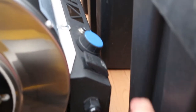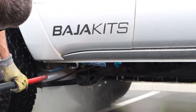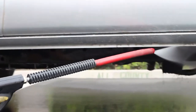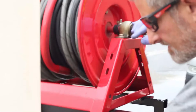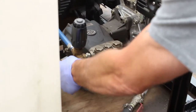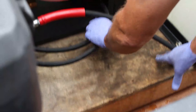When you're done, just turn off the burner. You want to run the water with the burner off until it comes out cold — I don't turn it off and leave all that hot water in there; the coils need to cool down. Then after that, you can turn off the pressure washer, drain the water, and roll your hoses up and just hook up your jumper hose again.